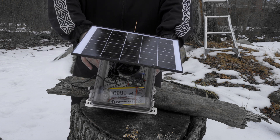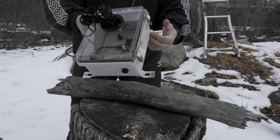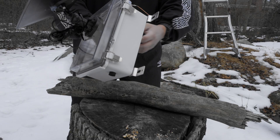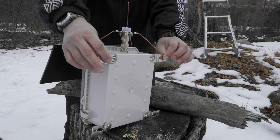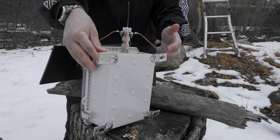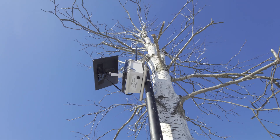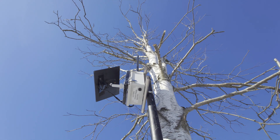So that is the repeater node. This box is super big for what I'm doing — you can get much smaller boxes — but I figure this could give you some ideas on how to build your own nodes and how to mount them. When mounting, I either use wood screws directly into a tree on the holders, or I use paracord wrapped around the tree, which is easier but less robust. There are also rail mountings available for the back of this, and pipe or pole clamps if you want to mount it on a pole. I've made a couple of these already and they work fairly well with these quarter-wave ground plane antennas.